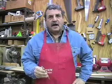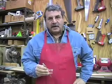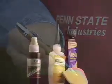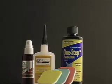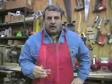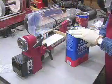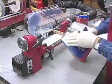Today we're going to make a rhodium Polaris pen made out of olive wood. What we're featuring is an extraordinary gloss finish made from the I Can't Believe This Finish finishing kit. To start off, we're going to start having sanded the blank to 400 to 600 grit. The first thing we're going to do is clean up our blank with some denatured alcohol.